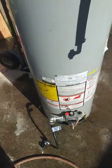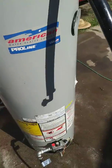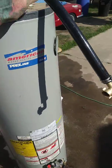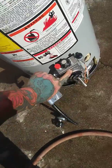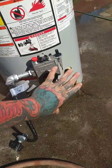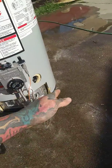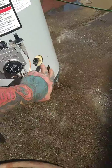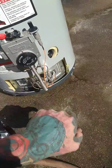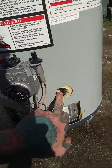To get even more out, you want to tilt the whole water heater and shake it. You want to tilt it this low — really get it low — but be very careful you don't want this stuff to get damaged or hit the floor. Get it just low enough to where it's clear from the floor and not touching, and all that white stuff will drain out completely.